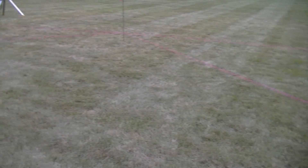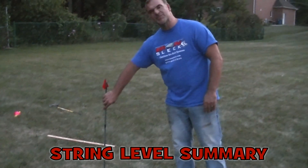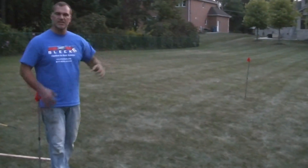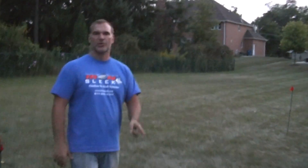If you have any questions, we can go over this process — I'd be glad to teach you and help you succeed for your backyard rink. In summary, some key things when measuring grade with a string level: make sure you're using tall rebar spikes with grooves — the grooves hold your string in place, and they're tall enough to bury deep in the ground. Document your spike positions. Place your string level straight in the middle of each string stretch. Make sure your string is taut. And when you're all done, make sure there are no bumps or humps by checking the diagonals.